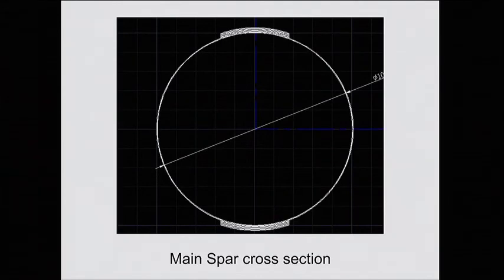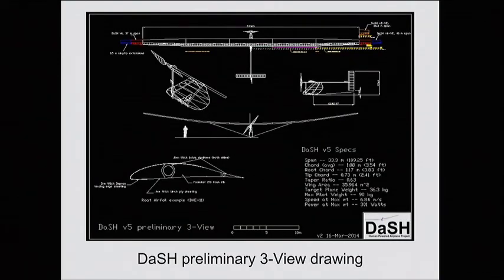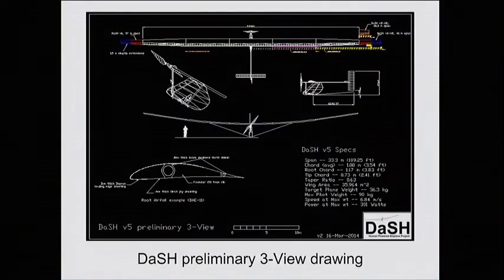This is the main spar. There are two torsion layers at 68-degree angles — most optimum would be 45 degrees, but this had to do with how the spars were built. This is about 0.4 millimeters thickness, and then there's a bunch of spar caps going longitudinally along the span. The nice thing about carbon fiber is you can tailor it to be strong in the direction you want. We go from eight layers of spar cap in the middle and taper it by tapering the number of layers: 8, 7, 6, 4, 2, 1 by the time we get out to the tip.